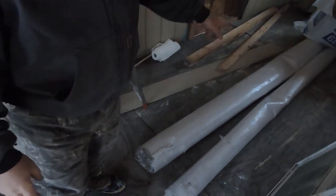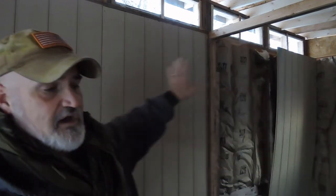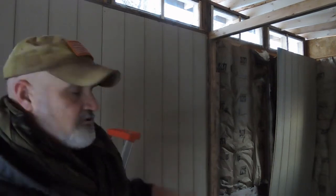I'm going to try to put trim up there eventually to make it look nice, but the chickens really don't care what it looks like, so that's not high on the priority list. Another project to finish this up is we've got two rolls of linoleum we're going to put down throughout the whole thing so it's easy to clean — that's one of the reasons we put siding on the inside, to make it durable. Then right here I've got to put a two-by-four wall cladded with wire so the chickens can't get through and are secure in the coop.